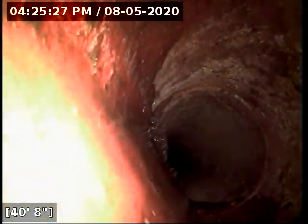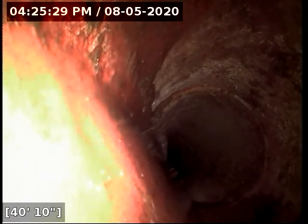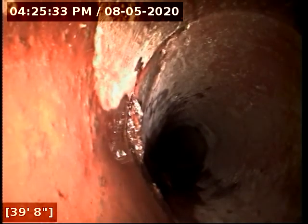Alright, I got this marked. It's about 5-6 feet out into the roadway, marked with a white X. It's right at the edge of the patch they cut into the road when they put the line in. We're about 7 feet deep there. You can see we do have a pretty good sized root coming through that. It looks like stuff by and large is getting over the top of it, but could also cause a blockage if you get enough junk collected in there.